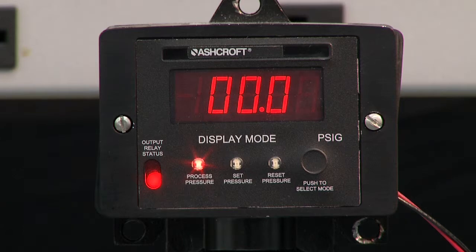This is the N-Series switch — an NPI version. It is an electronic pressure switch, which is easier to set than a mechanical switch because you can set it without actually having pressure applied to it. You set it by simply scrolling across with the select mode buttons and then removing the cover and adjusting the set point.